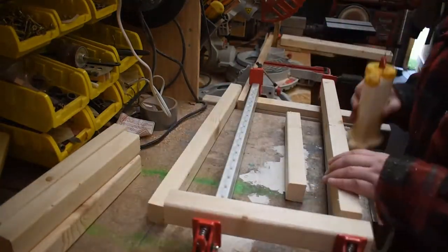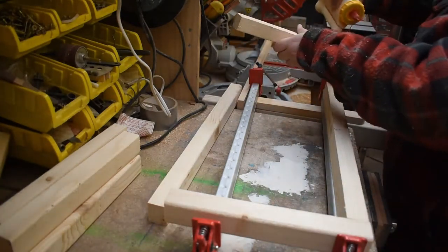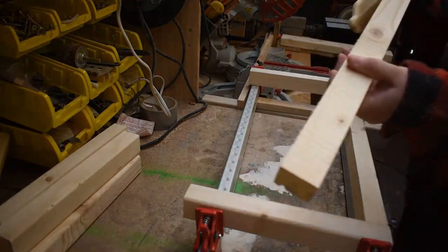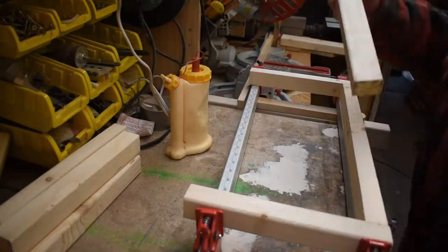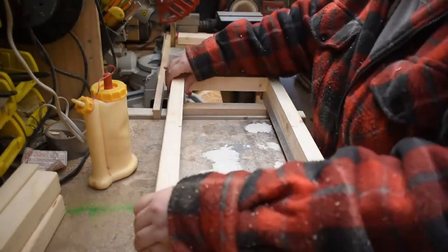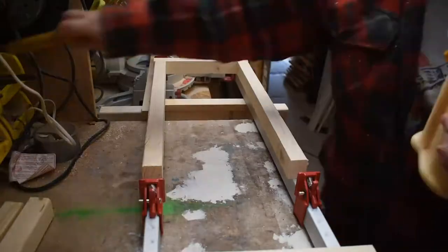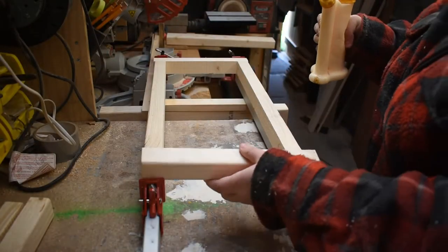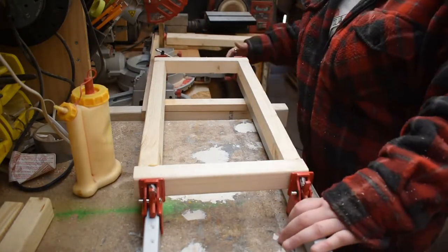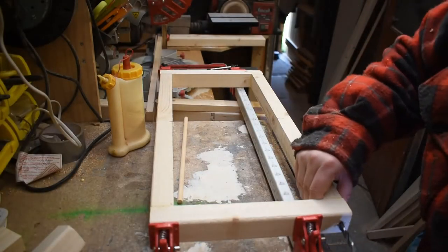I laid it out into a rectangle shape and glued them all together using just butt joints that are going to be reinforced with some dowels later on. I didn't want to use any screws on the project because my plan was to cut a four to five degree angle into the frame, which I've not ended up doing — I've done something slightly different but it was nice and strong anyway and worked out absolutely fine.